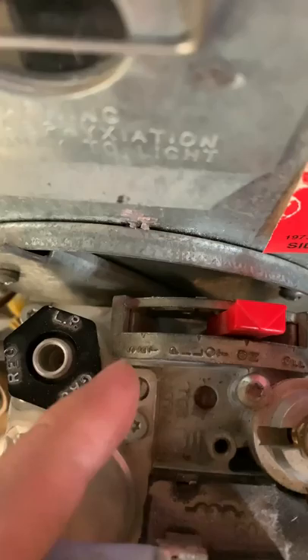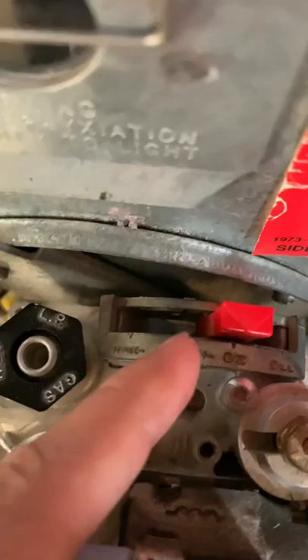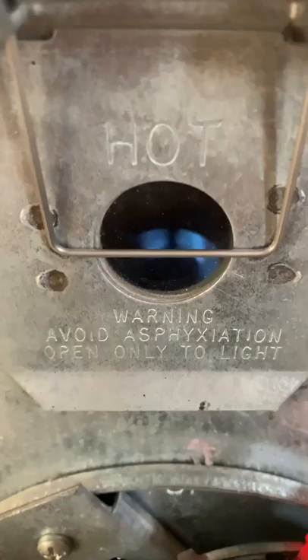See how that says 'on', 'pilot', and 'set'? You're going to put it on pilot — switch it over to here by pressing down and then sliding it over. Then you're going to pull it back to 'set' and let it go, pull it back and let it go.